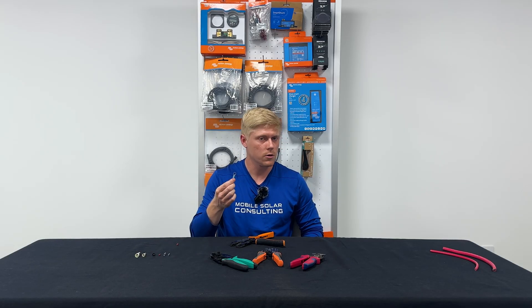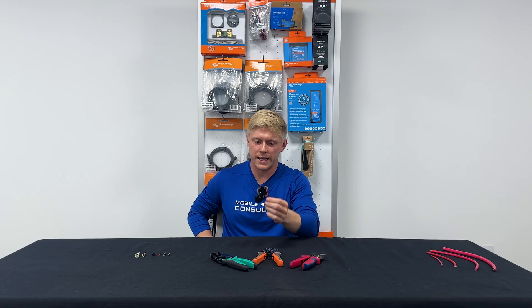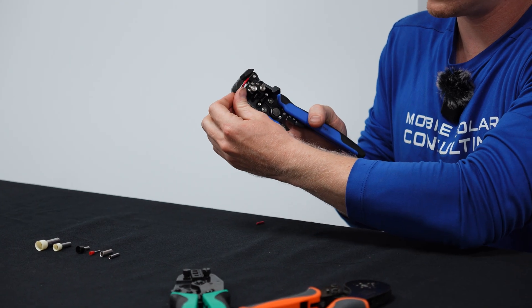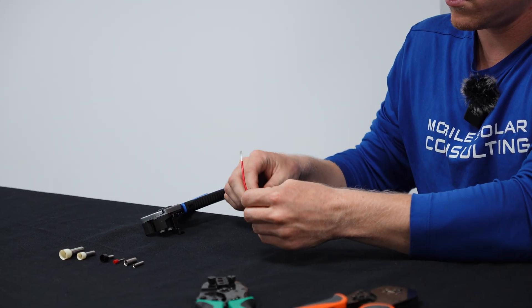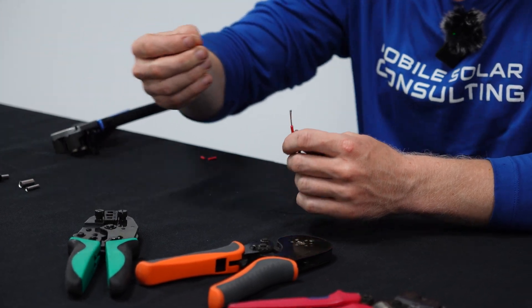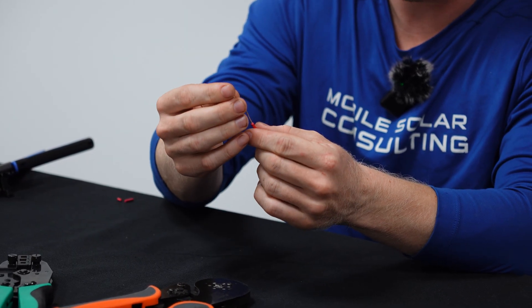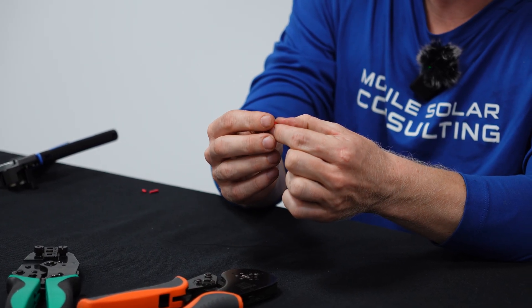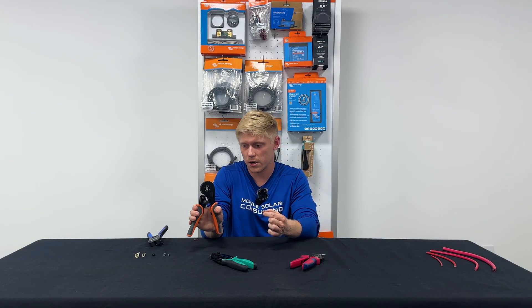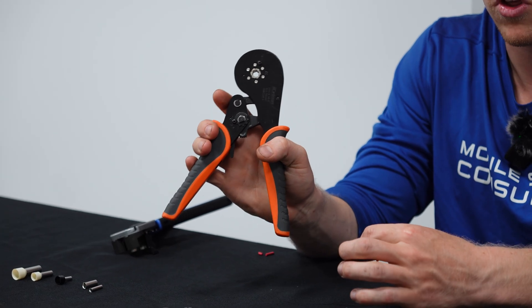The blue color is for 14 to 16 gauge — we don't have any of that wire today, so we're moving on. Now what we get a million questions on is ferrules. A lot of Victron components require ferrules and some require a specific crimper as well. We're going to start small with an 18 gauge wire. Strip a bit, and we use a ferrule with a 12 millimeter pin. Twist the wire and just slide the ferrule right over top. This one crimper is going to work for anything from 18 gauge to 6 gauge. This is an awesome crimper, but notice this is a hexagonal shape — keep that in mind.